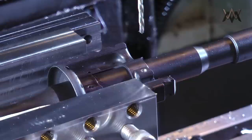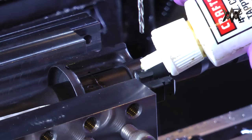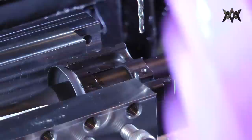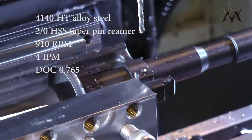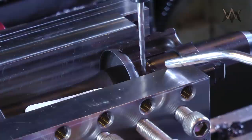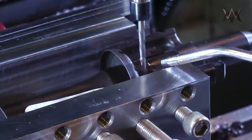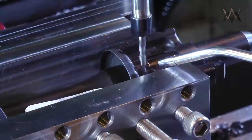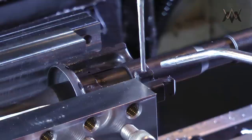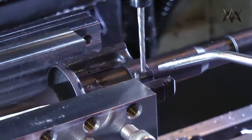So then moving on, next we're going to do the reaming, and of course this reaming stops short of a full ream, so I can finish it up by hand, but it does the majority of it. And it started slipping in the collet on this one too. So this collet was small enough to be able to completely clamp it. I just must not have had it clamped down tight enough.